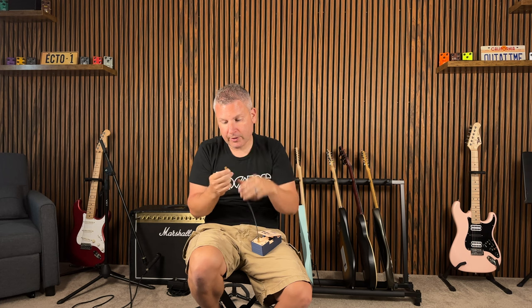The other thing I found a little difficult is the set screw — sometimes it comes out, and with my fat little fingers in there, it was hard to get it back in. But I found a trick: get that allen wrench, put the screw on it first and then put it in. Don't try to thread the hole and then try to screw it on — just put it right on top of the allen wrench itself and then screw it back in.